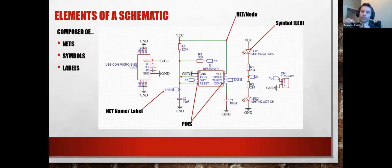But the stuff I didn't need to solder are a lot of the small units. Anything with R or C, I didn't solder. U1, I didn't solder. And all the diodes and whatnot, anything marked or denoted with D. But if it's bigger, like the buttons, the pin headers, the LCD, I put a lot of that on. It's a little bit simpler to solder something that's, we call it DIP, which is through hole.